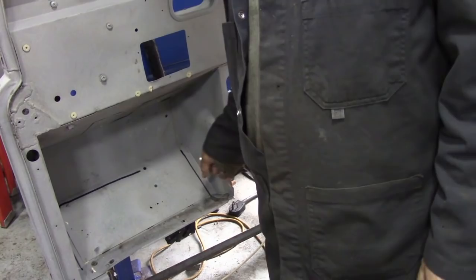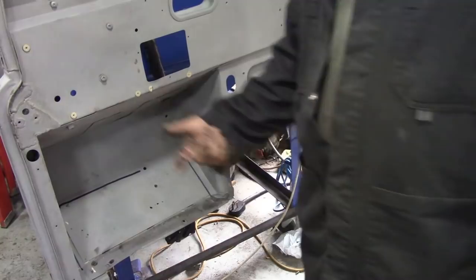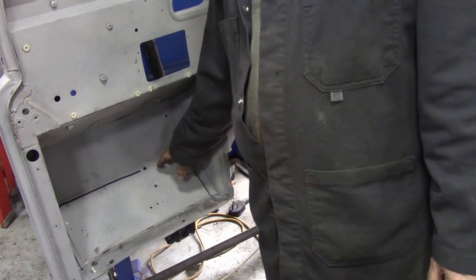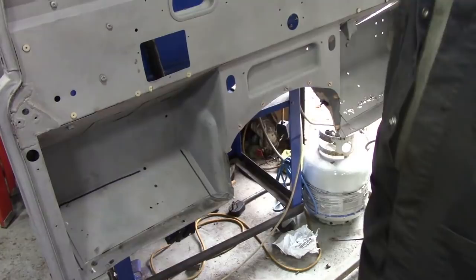Now, some of the footwells that come already come with the end plate on the kick plate, and you sort of drop them in. If you can get away with it, don't do that. And the reason is that when you start putting double thicknesses of steel on, water and condensation will get into it. So I'm going to cut those there and around here, and it should fit like a glove. You shouldn't be able to tell any difference. It will be a tiny bit higher, but it'll be quite good. And then what I'll do with the pieces of metal that I've cut, I'll punch in some spot weld holes all the way around the circumference and just spot weld it. And then when we put some seam sealer on, you will never tell the difference.